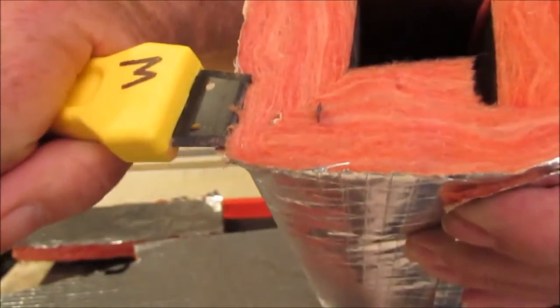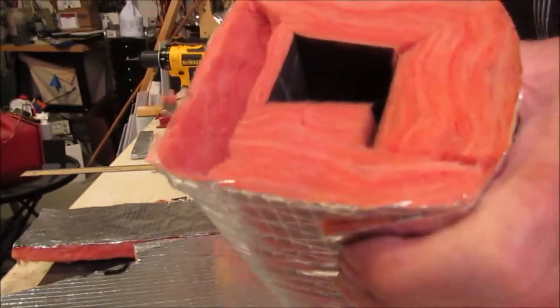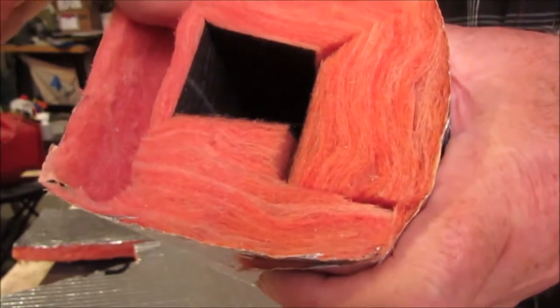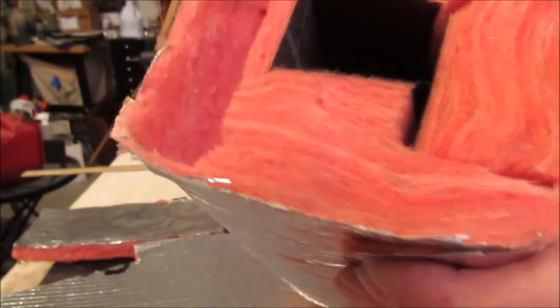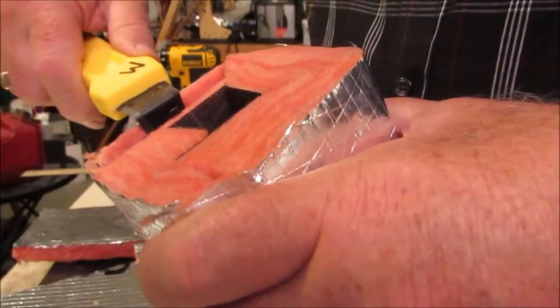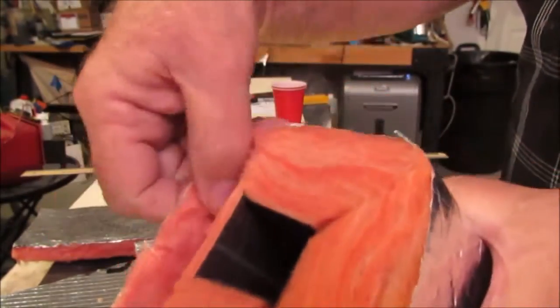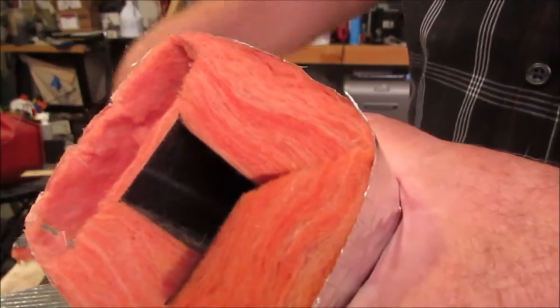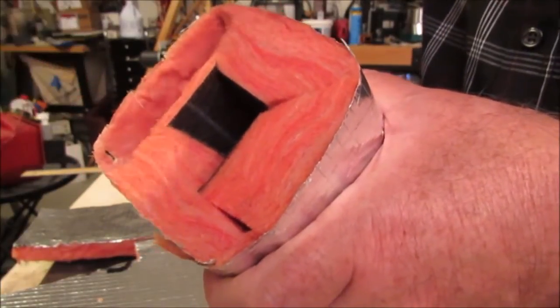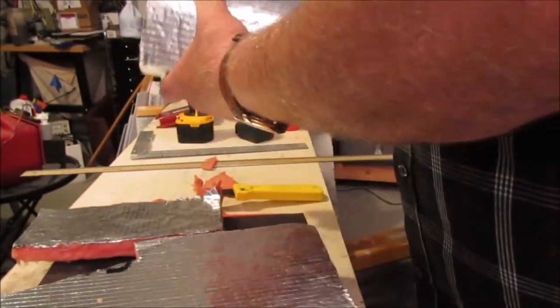I'll just move it along following the foil until we get to the end. You might have to work it out. This piece is small so it's hard to cut, but you can see there's the shiplap that favors the inside — that's a male shiplap and that's how you cut it. I've cut out most of everything. This is a piece I made for demo purposes, so it'll be a lot easier on a larger piece of ductwork. But here you can see I've got foil that I'll use for stapling, and the female end will plug into this male end.